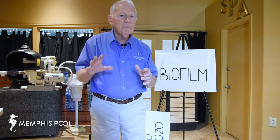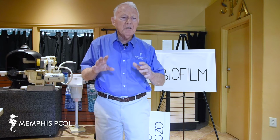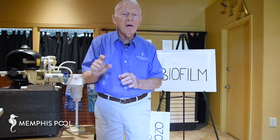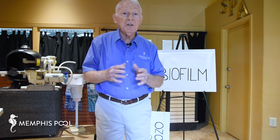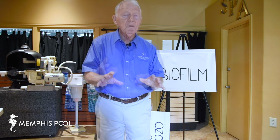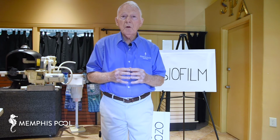It's just not. Now chlorine, I don't want you to get the idea that I'm trying to downplay chlorine. We have to have it. It's good. It works. It's there. But you can always build up a residual and measure what you have. But you can't do that with ozone. And also, with chlorine you're measuring and keeping the pH where it needs to be. But ozone, as I said, doesn't care. It's a very good complementary or supplementary substance to go along with it. They really complement one another. They work well together. If you don't have an ozonator, you may want to try it. They're not expensive for what you get from them. They're very, very cost effective, and I would welcome you to try that.